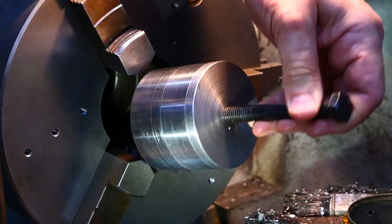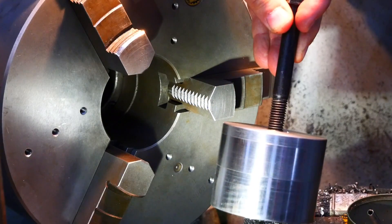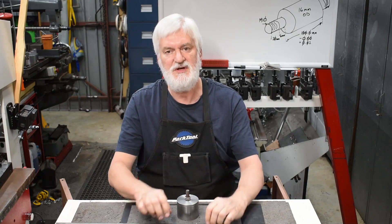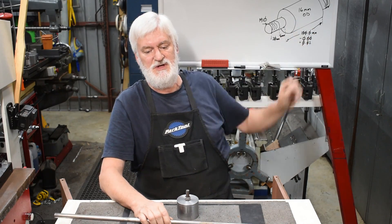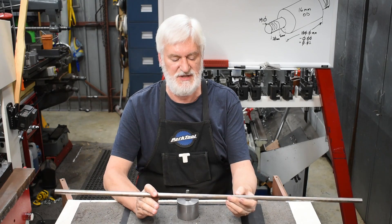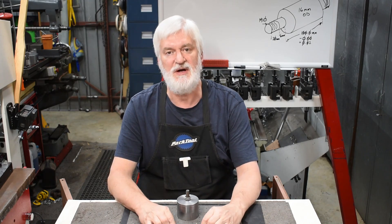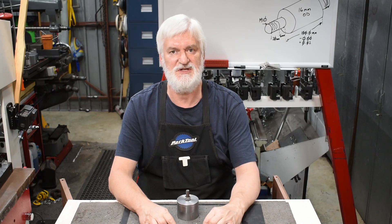There we go — well, there's another one done. Pretty sure this would do the job if I take on the project of making 50 of those things for my mate. But I also have a tool that's useful for other things afterwards. One thing I didn't say was that the external diameter is not critical, so if I take it on I'd just be using 16mm diameter rod cut to length — that's why it would work so well working with the collets in that collet block. Hope you found that interesting. Thanks for watching. Maybe you could subscribe — that helps me understand what people like seeing. I hope to see you on the next one. Cheers.